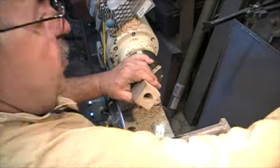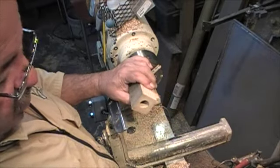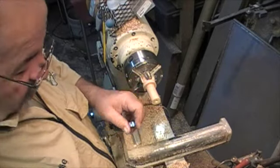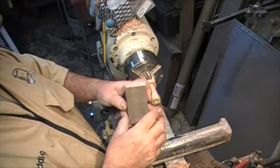The depth of the hole, well, let's see what we made it. I'm about 2 1/4 inches. The depth of the inserts are right at 2 inches. Why am I a little deeper? Because that's to this part here. And when I shape this thing, I may reduce it some, and I don't want to go back and re-drill the hole. So, I know it's 2 1/4, which means I can safely remove about 1 inch before I start looking at the inside. Not a lot of terrible stuff if it goes all the way through, but you want some bottom weight. So we're going to leave a little bottom on it.